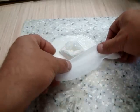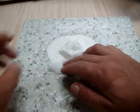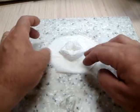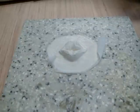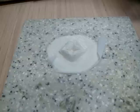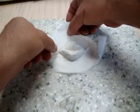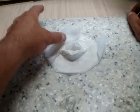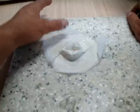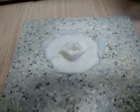That's still wet. What I want to do is start reinforcing this flange. It's still wet so I can push it in there. I've already got the first coat dry, so you're not going to see a print of the gauze. The idea is that when I peel this thing off of this piece of Corian, I'm going to need it fairly strong so it doesn't tear or rip. That's what the gauze is going to add — that layer of strength that might otherwise be missing.